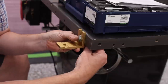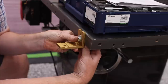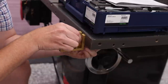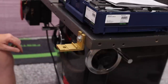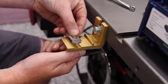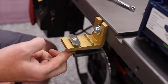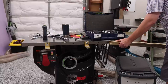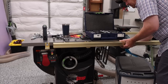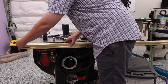Next, you're going to install the mounting brackets. This fence comes with a total of six brackets — three for the front and three for the back. I'm telling you right now that this is not enough if you plan on using the existing extension table on the SawStop. When tightening these brackets down, do not fully tighten them at this point. You will need to adjust these multiple times during the process. Only tighten them down enough to support the rail when you slide it on.